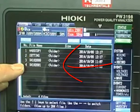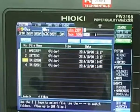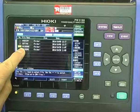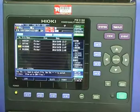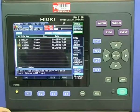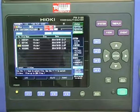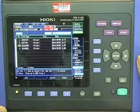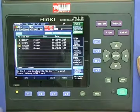Now we're recording again. I'm going to record a little bit and hit stop. There should now be two logs on the SD card. Going back to system — record waveform and memory — there are the two logs we've taken, because we started it twice. It's in analyzing mode, so we'd have to do a data reset, removing data from internal memory but not from the SD card. You can recall data from the SD card if necessary to bring it back in. So that's the Hioki 3198 as supplied by Tech Rentals — a very precise, highly configurable, easy to use system, and Tech Rentals supply a very comprehensive kit with everything you'll need.